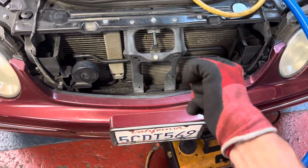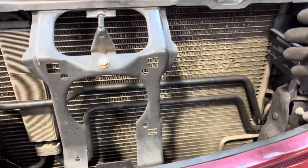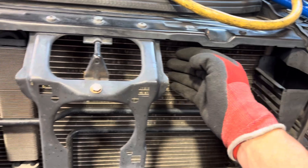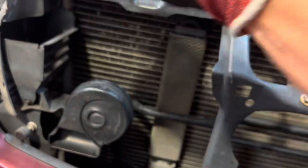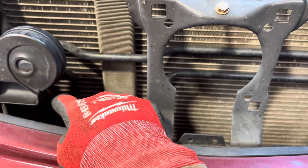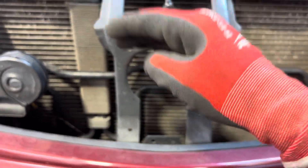When you look at it with a camera, you can see where the block-offs are — there's a little metal disc that protrudes on the outside so you can tell where it is. Say your high-side discharge comes in over here: some particles will pass all the way through the tubes, some will block a bit, but they'll hit the other side and congregate at the lower part where it blocks the second pass. You look at the lower tubes and you might see one, two, or three lower tubes blocked. On your infrared camera they'll show up as blue or black areas while everything else is pink, red, orange, or white.